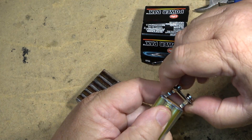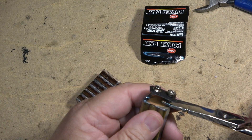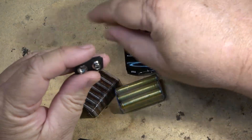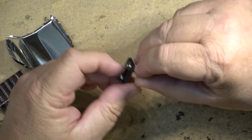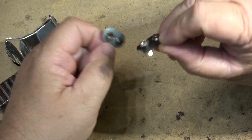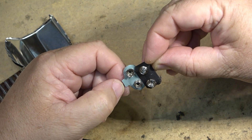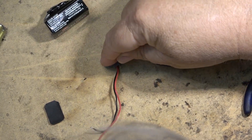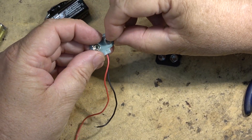All you need to do is take your tabs and cut them. Now you have a battery terminal that you can reconnect to your device. Now which terminal is which? You need to know that so you know which wire to connect to which terminal. The positive wire goes to the connector that has the spring clips. The negative goes to the smaller terminal.